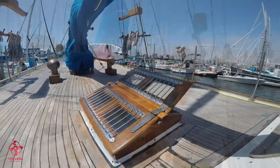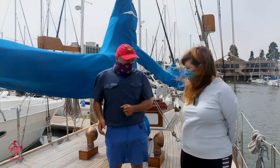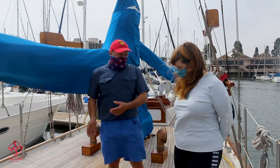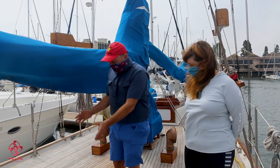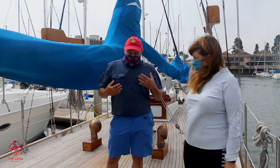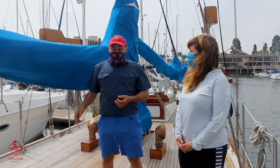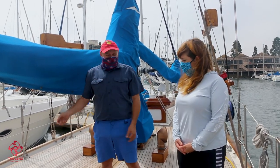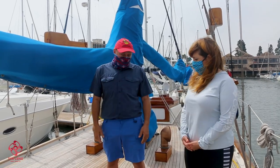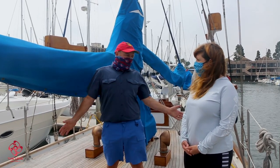It's a very interesting-looking window — it's called a butterfly hatch, and it gives you great ventilation down below along with a lot of light into the middle of the boat. That's its main purpose. The other purpose: it's really helpful when you're changing large systems, because the entire hatch can come off and now it's a cargo hold. When I changed my batteries out I could hook a block and fall to the boom and pull them straight out. When I put my new stove in it fit through here easily — block and fall, lowered it right down. So it's actually very handy: a lot of light, a lot of ventilation, and great for getting big things into the boat.